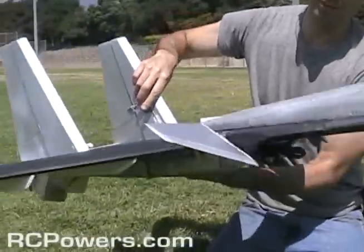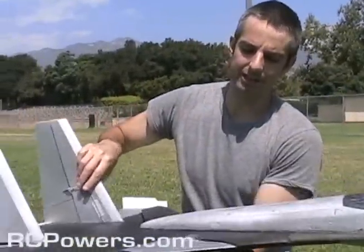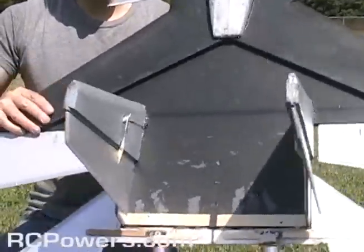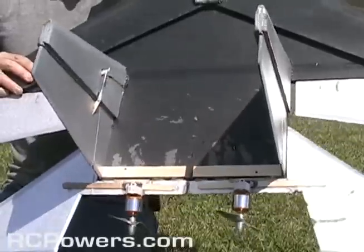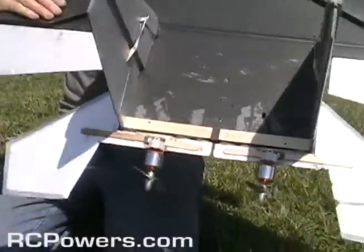Look at the canards on the front. So when the plane senses unwanted pitch movement, the gyros can correct that for me. See the gyro on the rudders? So when it's up doing high alpha and starts to get waggy, the gyros correct that. Same thing with the roll, both with the rear elevons and the ailerons.